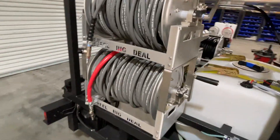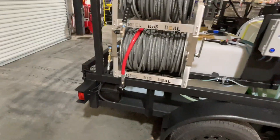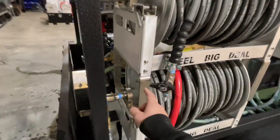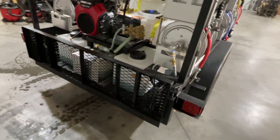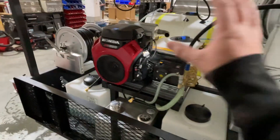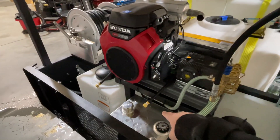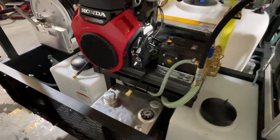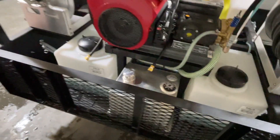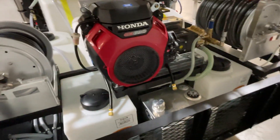That upper reel is the 12-volt soft wash reel, and then it's a 24-volt reel. Then he's got two pressure reels on the back — 18-inch reels on both of those on stack kits, which we make as well. So the reels and the stack kits, got some extra features on the back there. A secondary cold water eight-gallon-a-minute machine has its own fuel tank here, and we went ahead and upgraded him to one of the new eight-gallon aluminum tanks with the sight glass on there so he can see it.